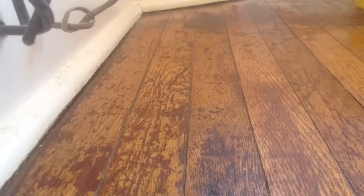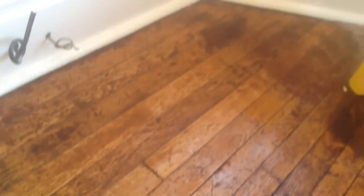Alright, there we have our floor — all the paint is up. You can see the texture here, and you can see the paint we had on the old floor. All the paint is gone. Now we'll put two coats of finish on here, two coats of shellac, because that's what I think the original finish was. And we'll have it refinished without doing any kind of sanding, and the paint's all gone.